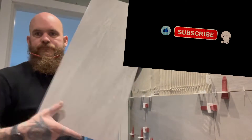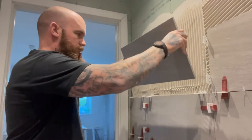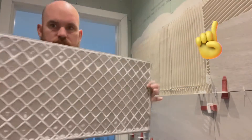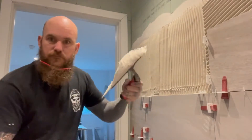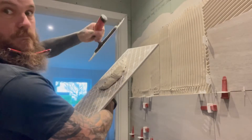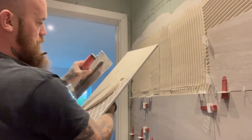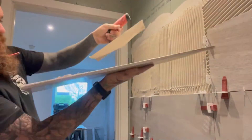Let's talk about laying tiles — porcelain tile. We're going to back butter that tile, putting a thin bed of adhesive on it. This is really good practice for any type of tile. When you do this, you are ensuring that you're going to get the best bond between the wall or the floor and the tile.